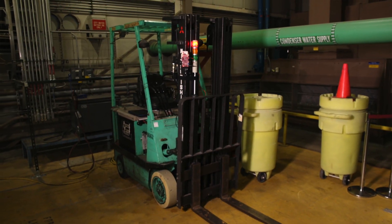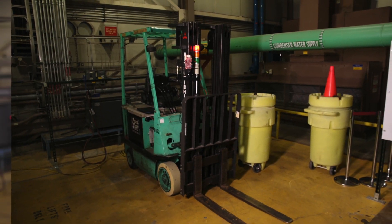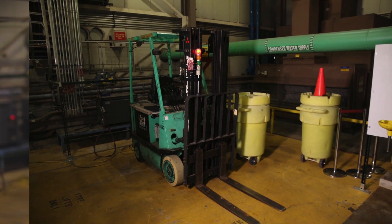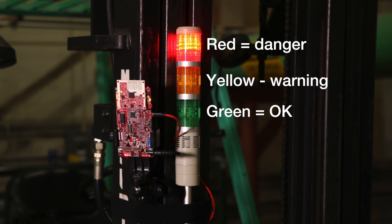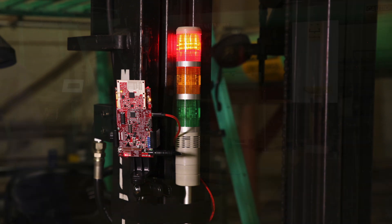In this example, you will see the millimeter wave sensor is configured to monitor a specific area of interest around the machinery. We have partitioned zones so that the sensor can react accordingly based on the zone occupancy or proximity of the person, using point cloud tracking.